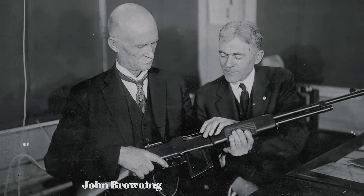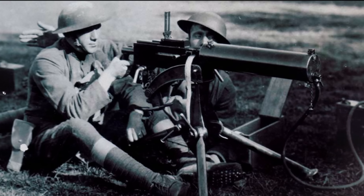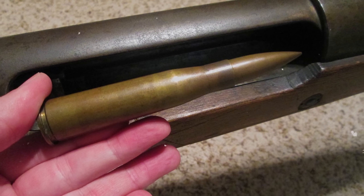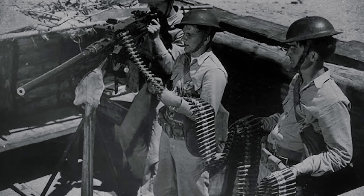The brief was to build a machine gun that fired a half-inch bullet at more than 2,700 feet per second. That was a serious leap from Browning's earlier work, but to save time he took the dependable M1917 water-cooled gun as a starting point, then scaled the design to handle a much larger cartridge. The ammunition followed the same logic: take the .30-06 concept, scale it up, keep it rimless so belts feed smoothly, and use lessons learned from a captured German 13.2mm anti-tank rifle round. Out of that came the .50 BMG — 12.7 by 99mm. No one realised it yet, but they had just created a cartridge that was about to impact countless wars for decades to come.